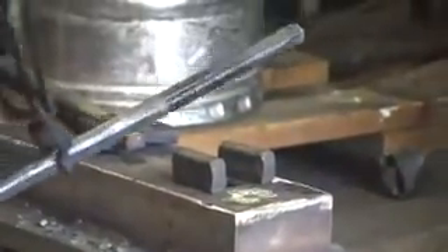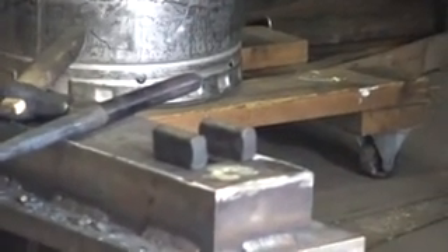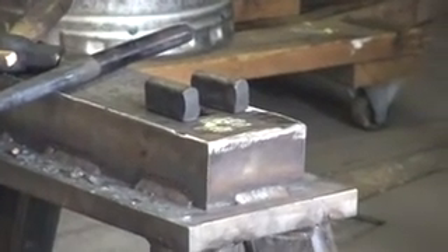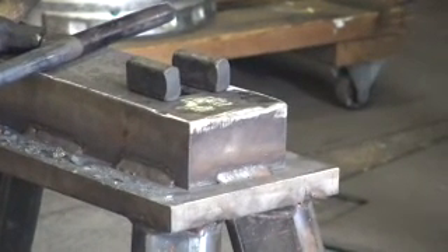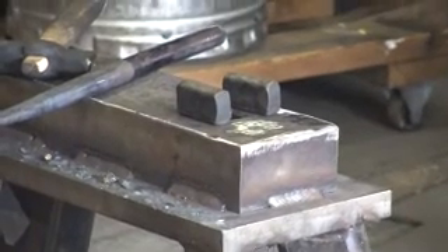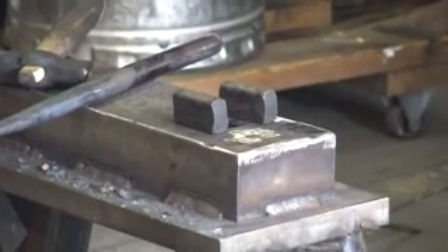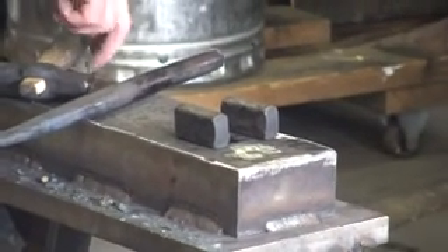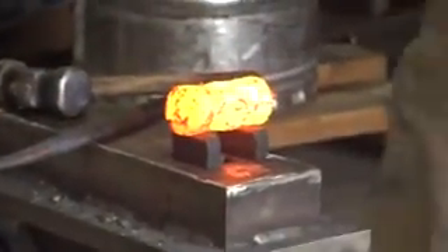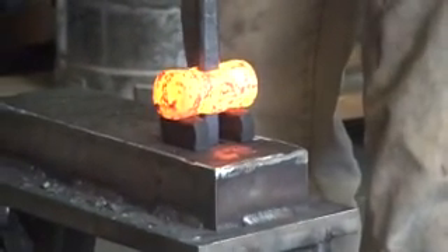Brent Bailey has basically the same thing — he calls it a bottom bolster. It's one piece with a curve on the bottom and two humps on it, and it also forges the shape underneath on the curve of your cheeks. I'll do at least one heat driving them through the hump tools, but then I'm going to switch to doing it over the swage block. I have to push down with my drift hand to keep the hump tool stable while I'm driving the drift.